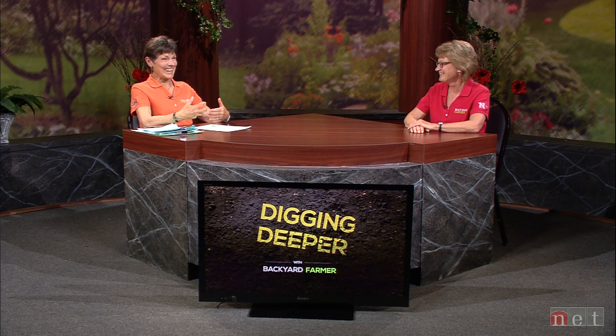A lot of people are aware of what we call the rain chain on East Campus in our Backyard Farmer garden. If they think about what Kelly just described and look at ours, they might think we don't know what we're doing — but ours is deeper on purpose. Each one is technically its own little rain garden with an inlet, an outlet, a berm, and a flat bottom with just enough slope. The reason we did that is to demonstrate what you could do on a smaller scale. The Backyard Farmer Garden is also taking rainwater from the street, so it's a larger volume of rainwater flowing into it. Kelly described a typical rain garden for a residential landscape that most homeowners could design and install themselves, but sometimes the sky's the limit if you're creative enough.